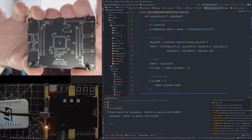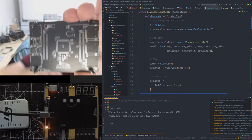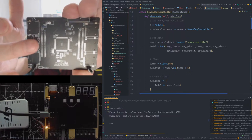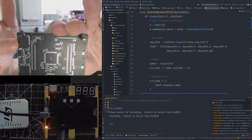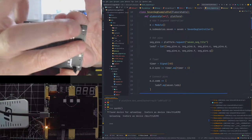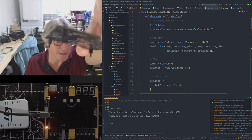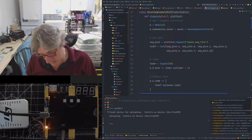It's a bit better. So in the centre there you see the STM32, that horrible TQFP 100 package. God, I hate that package. Also on here you've got the HyperRAM and HyperFlash, the normal USB for communication. Then you've got the SD card, then you've got blade one, and then the other blades on the other side, 2, 3, and 4. And then that sits on top. See, I've got some plastic legs on that. So that kind of fits on top.